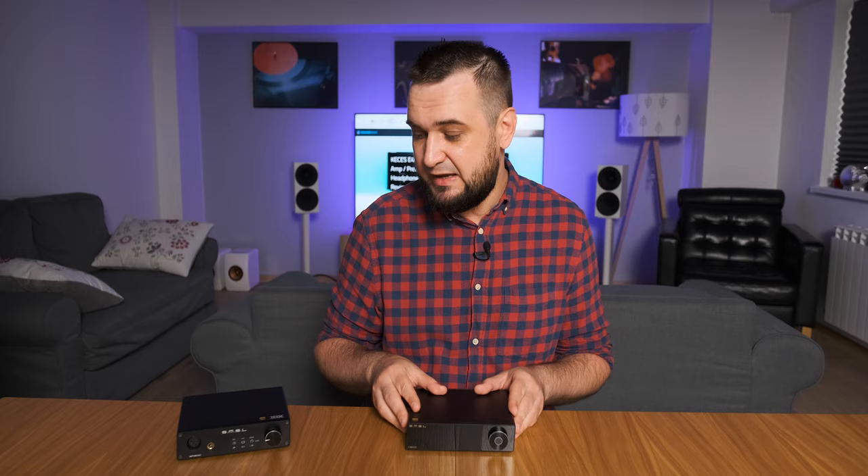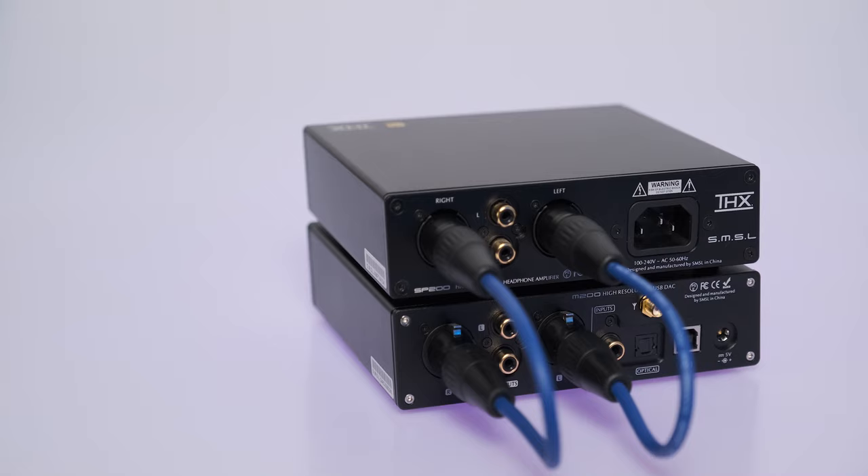I really like that SMSL went with a stronger signal on the XLR output — 4.1 volts — which works amazingly well with the SP200 headphone amplifier. With most of my headphones I'm staying on low gain, even with planar magnetics; high gain was used only with the Audeze LCD-4 and HiFiMAN Arya. I was able to discern all the smallest details a high-quality source should provide. There was a slight warmth throughout — tones felt richer, voices sounded fuller and more guttural, and there was definitely a little more midrange presence compared to others.